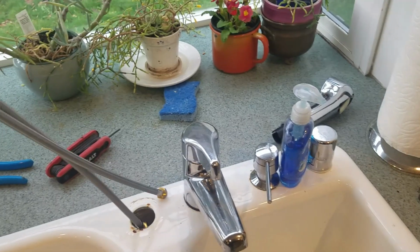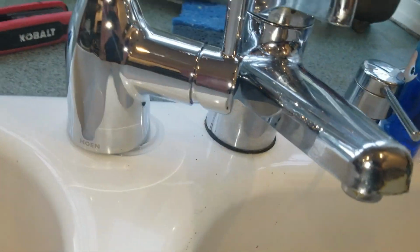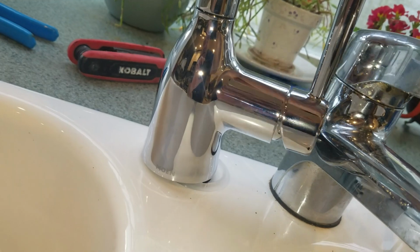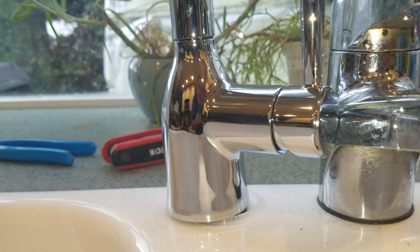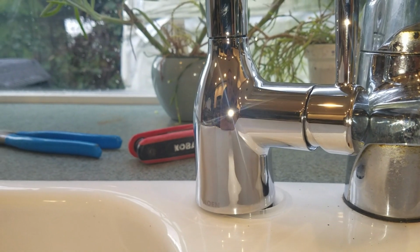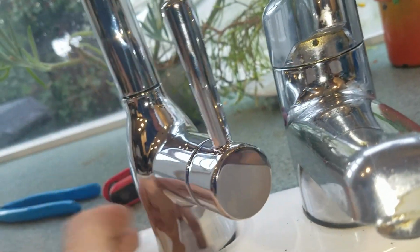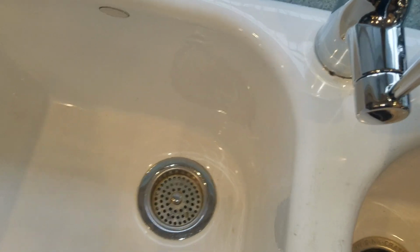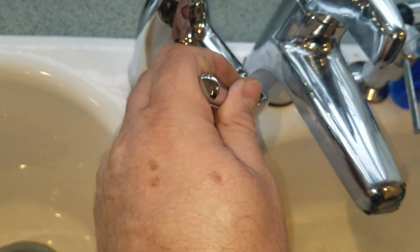Okay, let us begin putting the new faucet in. Just like that. There's the little nylon bushing that goes there. And, okay, now isn't that special? Our faucet doesn't clear the instant hot, and I'm not about to move the instant hot. So I can position it forward like that. And like that. Then we just open it, operate it this way.